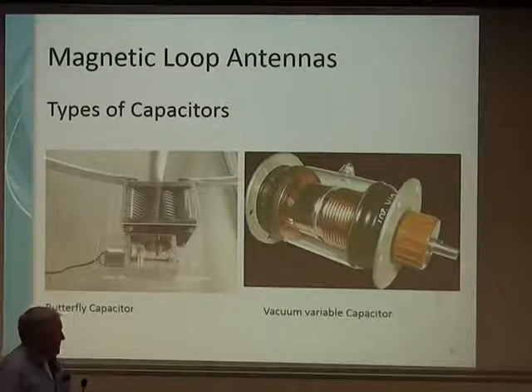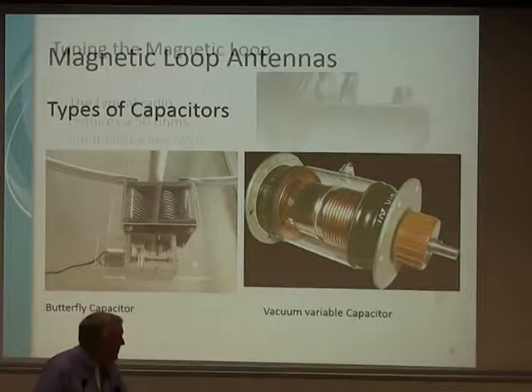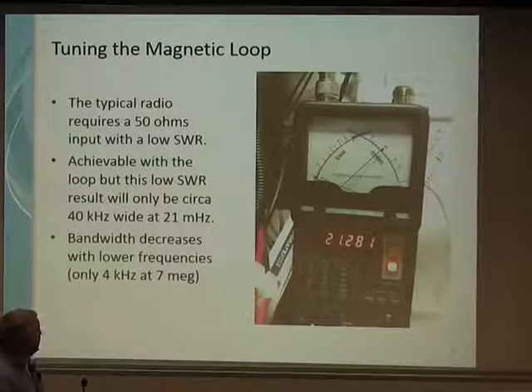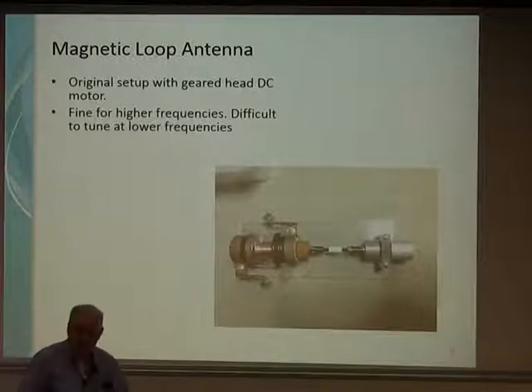There's an example of a match — 50 ohms at one-to-one, and it's pretty easy to achieve. The little transformer on that one works on any size loop. The gamma match, if you're making something permanent, is probably the best way to go. I think I'll let Dave take over from here — I hope you found that a bit interesting anyway.